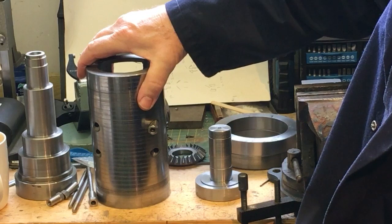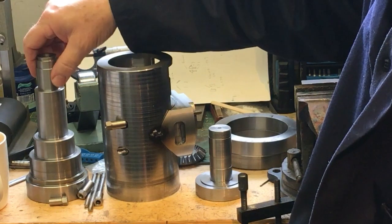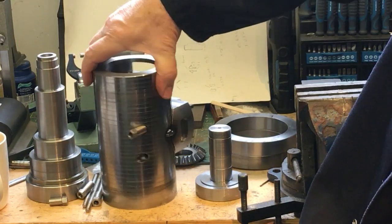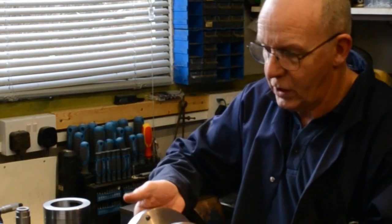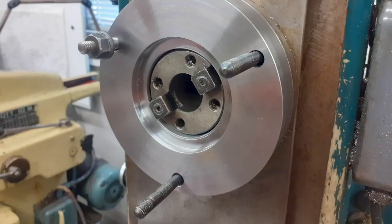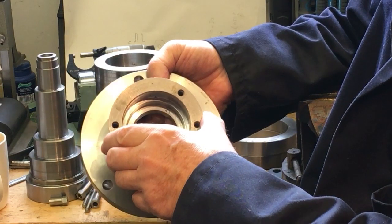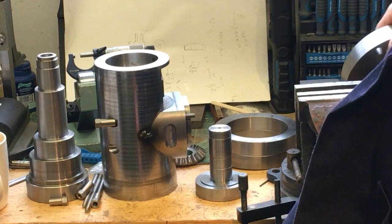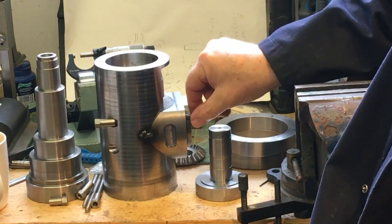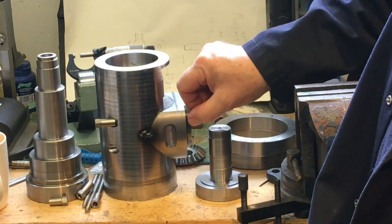What we have here is the spindle, which I videoed myself making a few weeks ago. This is the vertical section of the head. Behind me here is the horizontal section which will bolt to the fittings on the front of the body of the mill. The horizontal spindle will come out of there, driven by the spindle on the milling machine. I have four holes here to take studs, and those studs go through there and hold it up against this spigot — so it's located on the spigot, not by the studs. The studs will just hold it in place.